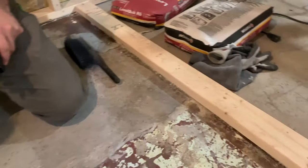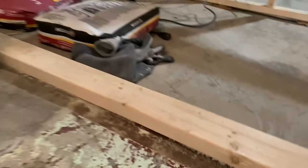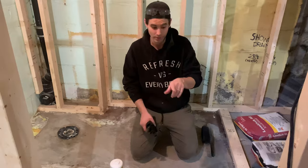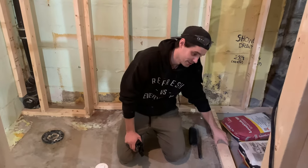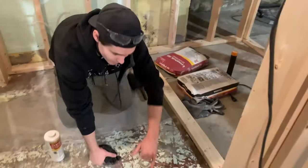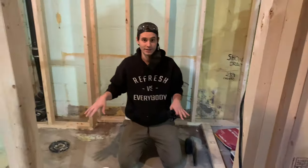It's difficult to see, but it's sealed underneath these — underneath the framing now. So when I pour the self-leveler, we're not going to get any seepage underneath. Some of this is just superficial. This curb piece right here is going to come up afterwards and we're going to have a nice level line. And this door frame is eventually going to get cut back, but I really just want to make this level and flat right now.